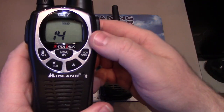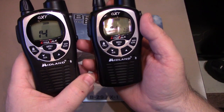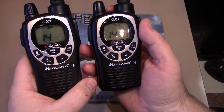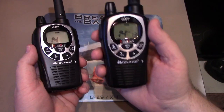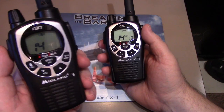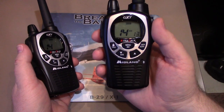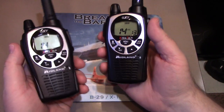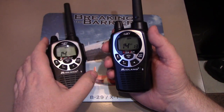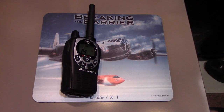You need to set your other radio to it as well. The way these work is both radios have to be set to the same code to squelch out all the other background radios. Right now, this radio in my left hand will hear everything my right hand transmits, but if I transmit with my left handheld, my right one will not unsquelch because it's not receiving that code 13. Let me demo that real fast.